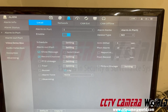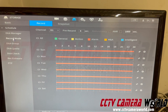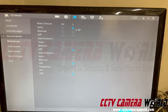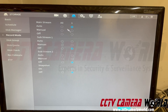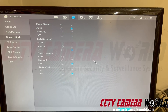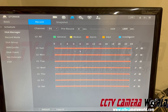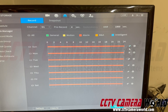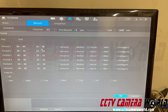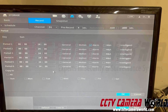That's one part of the equation. The second part is you need to go under Storage and Record Mode and make sure it's set to Auto for your cameras, because now you're going to give it a schedule. Hit Apply after selecting Auto. Make sure it's not Manual, because Manual means you're recording constantly. Hit Apply, then go to Schedule. If your schedule is green or yellow, you need to change it — click the gear/setup icon and make sure for 0 to 24 hours you only have Alarm checked, if you just want to record only when the alarm is active.